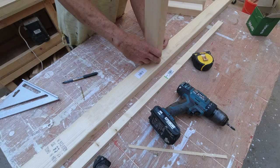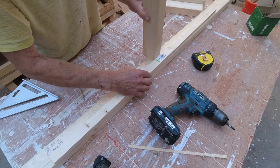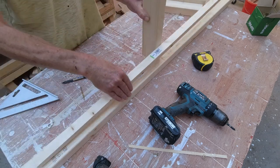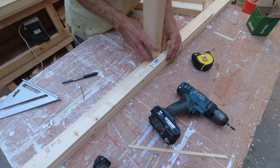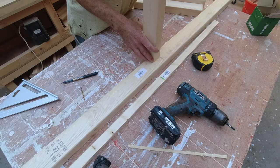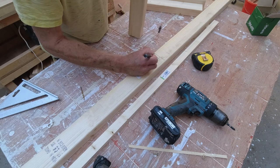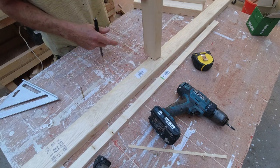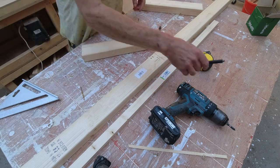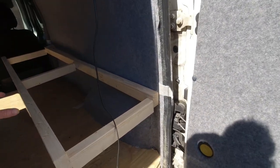So to fit these pieces - these are the width of the bed - this is the type of material I'm going to use to secure the backs of the sliders. This is going to slide up this way. I'll just leave a little bit of air, mark that, draw a couple of holes in there, and glue and screw it here. We'll do the same on each end of it and then get the front strut on, then look at the legs.